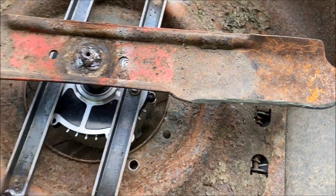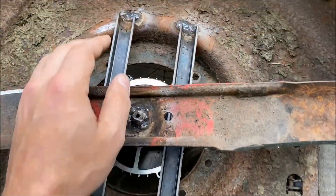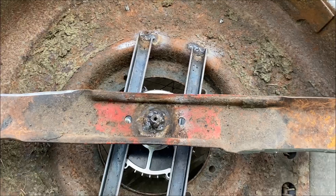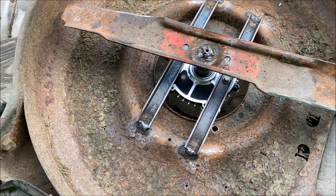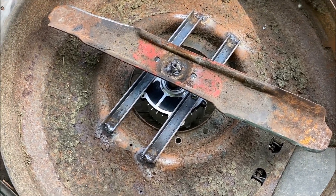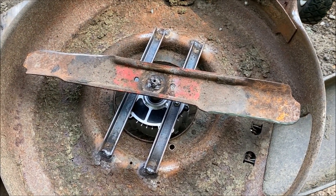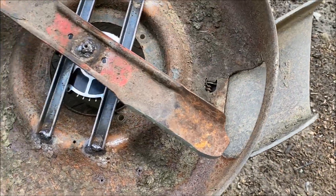This thing's all old and rusty. You can see where I tech-screwed the controller in through the top. I took the controller out of the Vector light bike - it's a 52-volt controller and you can run it on 36, 48, or 52 volts, so pretty convenient. I'm about to turn it on for the first time and I'm hoping it works, and I'm hoping it spins in the correct direction.